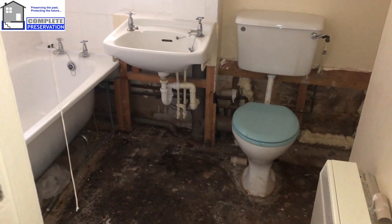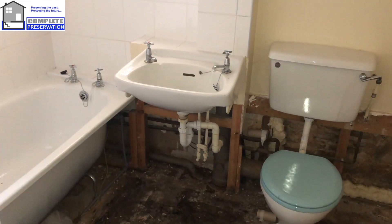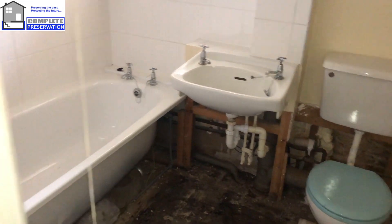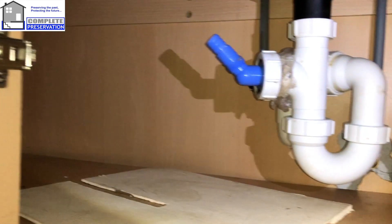I'm going to show you how we go through some of the basic stuff with this one. Really, really important where you can: leave the taps running, normally for like 10 minutes, give the toilet a few flushes. What's really important as well, when you're in these properties, is when you're turning the water on, just make sure where it's been taken off - like where the washing machine's been taken out - make sure nothing's leaking.